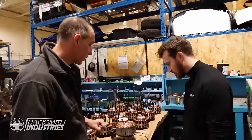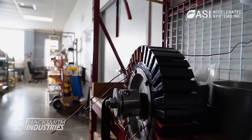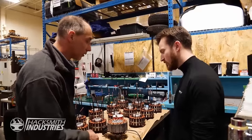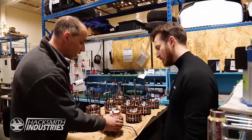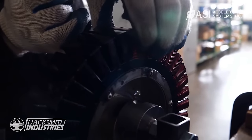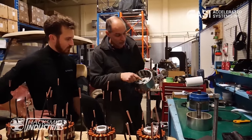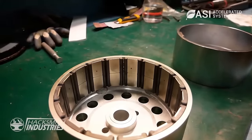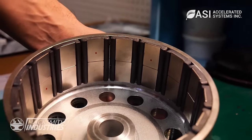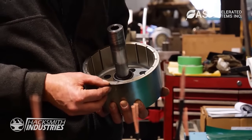The motor that you're going to put in for the higher torque application, what we've done is we've used multiple thin conductors in parallel. A lot of the motors, the high power motors that you see, have been wound by hand so that they're able to get the high current through. The first motor you've run uses a hybrid magnet. We've taken a small amount of neodymium and backed it up with a ceramic magnet. But for our new motor, it's pure neodymium. Very thick neodymium magnets.